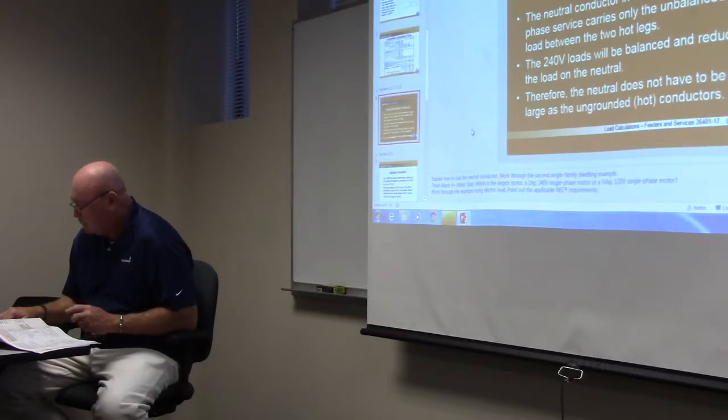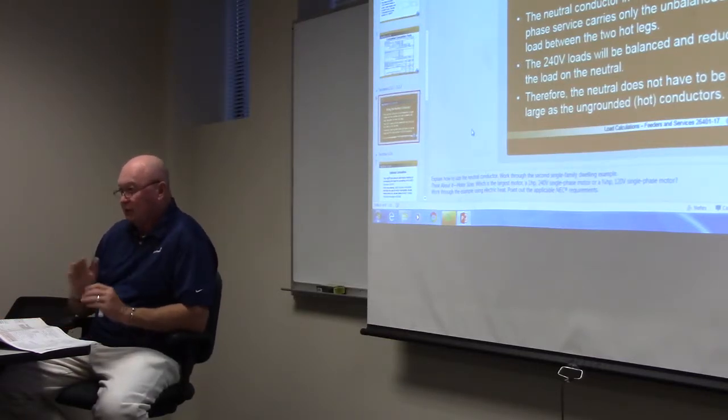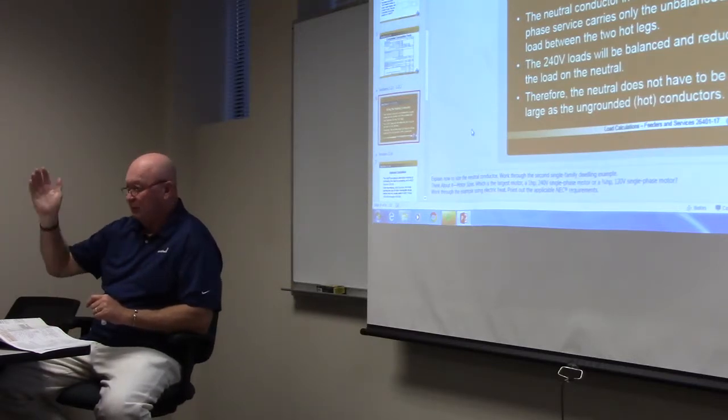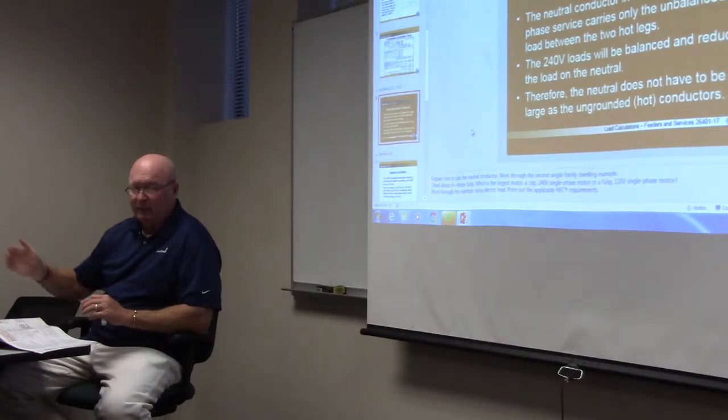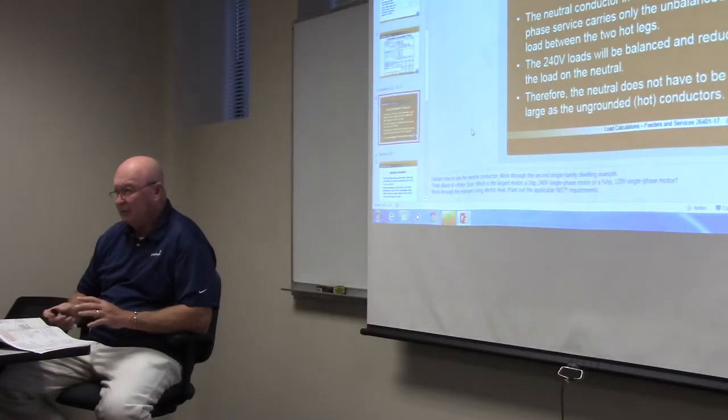Number one. Yeah. And so we're using a 75 degree column, aren't we? We're using a 75 degree column because it's 100 amps or more per 110.14(C). So, being it's 100 amps or more, we're using a 75 degree column. Okay. That makes sense, guys? Kind of makes sense?